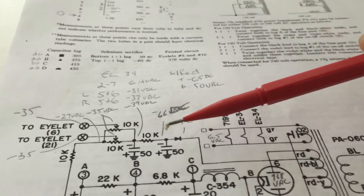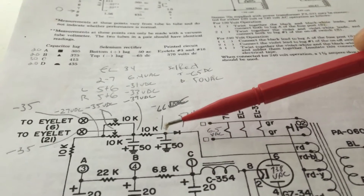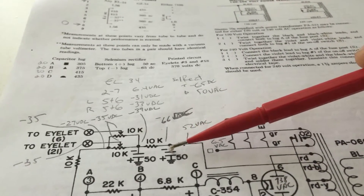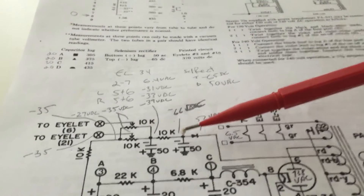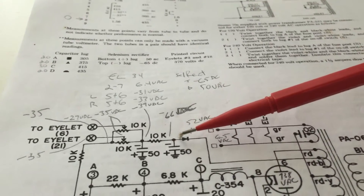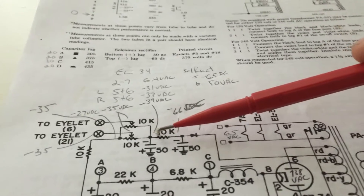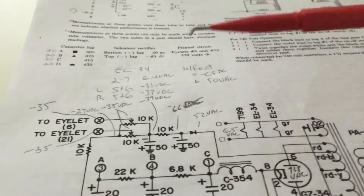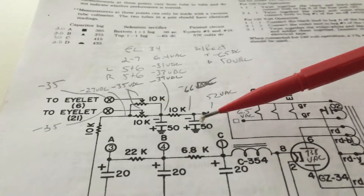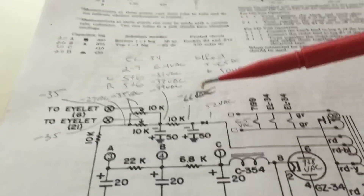What you want to know about this capacitor is, first, is it rated for the voltage that this circuit is using? I found 450 volts is sufficient and I believe it matches or exceeds the original specification for these capacitors. The other thing is the size of the capacitor, which will allow for stability to be increased. By increasing the size of this capacitor, you are not dramatically or noticeably changing the resulting grid bias voltage on any of your test equipment.